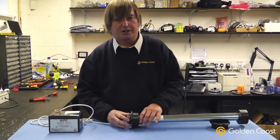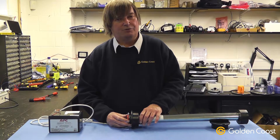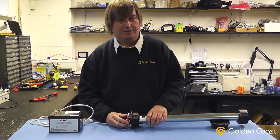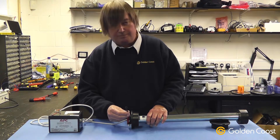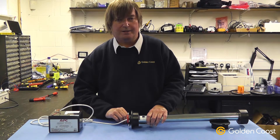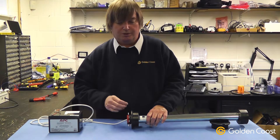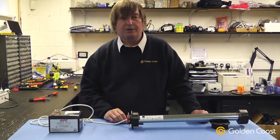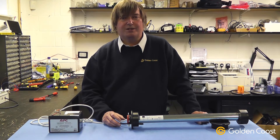There are no serviceable parts inside the tube and it should never be taken apart anyway, so if you did drive the stops off, you've completely ruined the motor and it could not be repaired. Take your time, sit down with the adjuster, get it right in both directions of travel, and once it's set properly you should never really have to adjust it again. Remember, never use a power tool to drive the adjustment key. If you have any other queries regarding setting up these automatic stops, please don't hesitate to contact us.